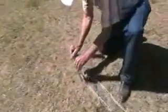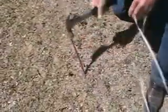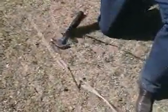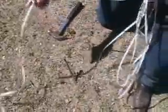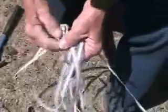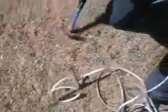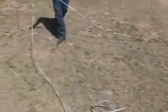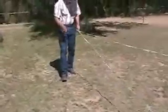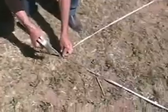We would just drive this first stake — drive them on an angle so it's leaning back about like that. Your first time, just set it in just enough to hold for the line. And then we'll go to the 20-foot loop, put that right on that stake, and stretch it out here to the tag again. Right at that tag, you'll drive another stake, and this will be leaned back.